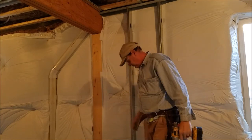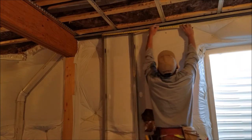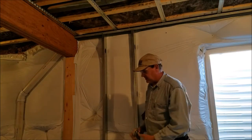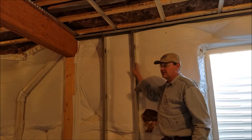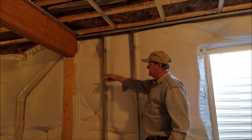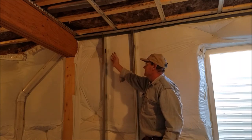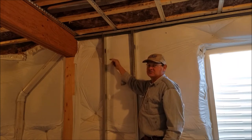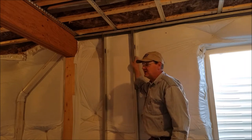Same thing down at the bottom. Now on the big jobs, the stud has two sides — the flat side is called the hard side and the open side is called the soft side. We always like to point the soft side, the open side, starting from our layout. So whenever sheet rockers come in they know that's where they should start their sheetrock, because they can just come in and start sheet rocking away.